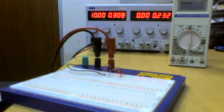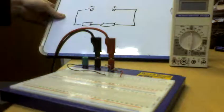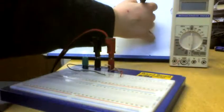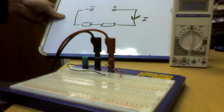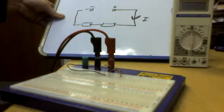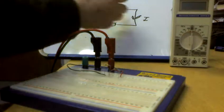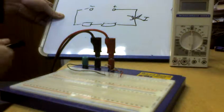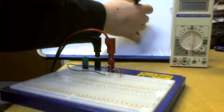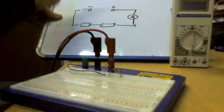How do you hook up your meter? Here's our circuit diagram. Current flows through your circuit — this arrow denotes the direction of current flow, positive to negative through the resistance. Where do we put our meter? We want to put our meter in here — to measure current you need to break the circuit, make an open circuit, insert your ammeter, and then you've got your ammeter in series with your circuit.